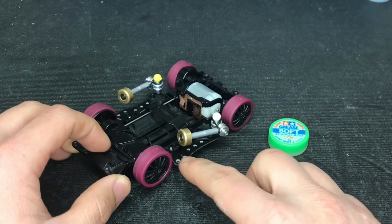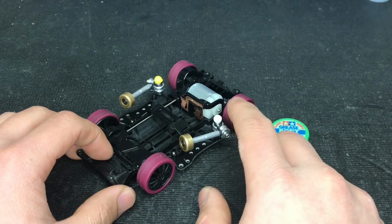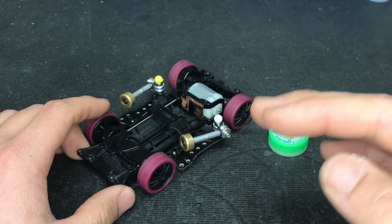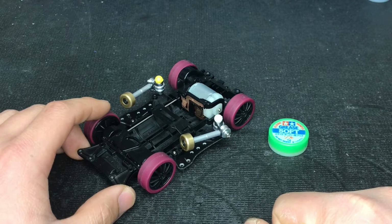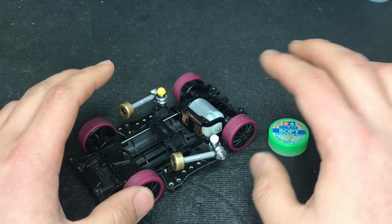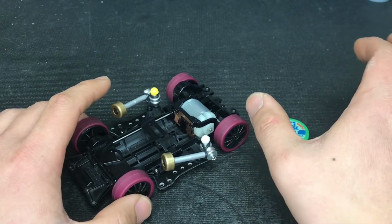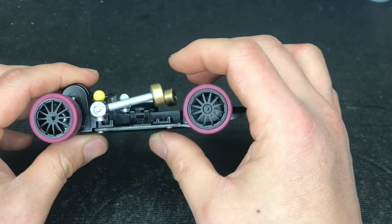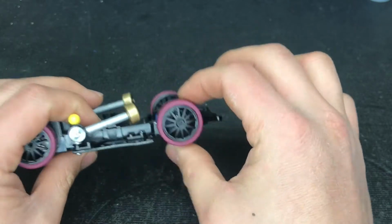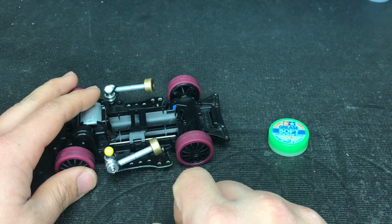Okay, so as you can see here, I'm using the boxing damper setup, and on the side, I basically just modified it a little bit and made it like hanging boxing dampers. So it's basically the same idea as the tail damper that we used to have. Like if you know, there are lots of people using the catcher at the back as the damper, and it's basically the same idea. So we have the boxing damper and use the o-ring to tighten it up, so the damper is hanging in the air, and when it's dropped you'll be able to soften the impact.